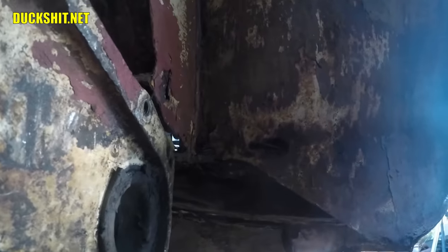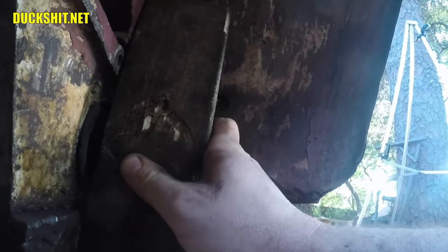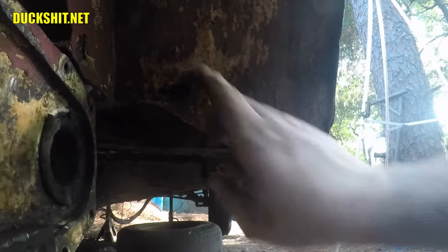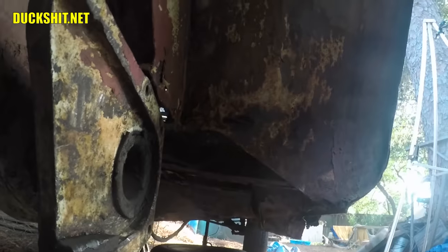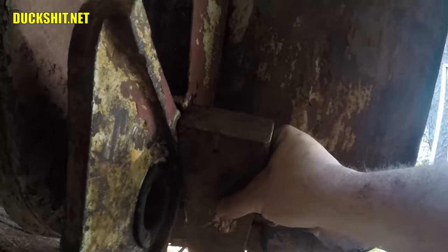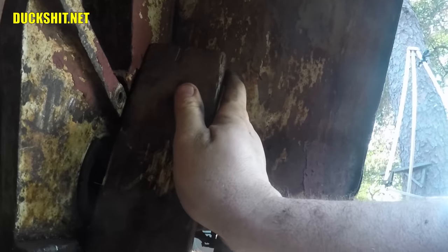There's our seam - it's a little less than an eighth of an inch, which is good. That means I can get the weld in there and get the two outer pieces and the inside tube all welded together by running a bead right through that gap. That is great. And on the outside - look at that - we are perfectly flush. The 2x4 isn't perfectly straight but you guys get the drift - at that edge it is flush, and that's where we wanted it to be. I am happy with that.